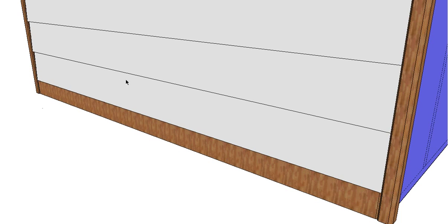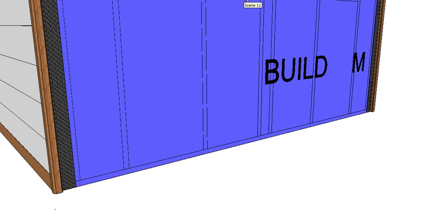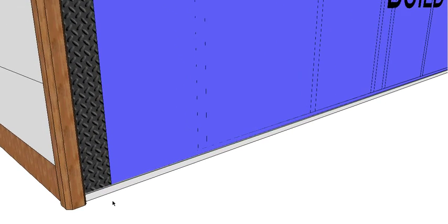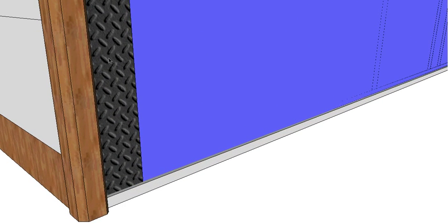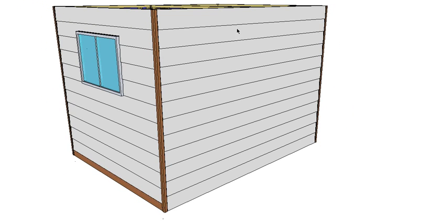The more common way to do it, there's your boards in place then. The more common way to do it is just to cut a strip off your weatherboards, and the actual top board you're going to have to run a strip off anyway, which is equal to your lap of your sheets. So you can nail that along the bottom, and that'll provide the kicker for your first board, so that they all sit at the same angle. The first one doesn't sit flat against the wall. So put your kicker in, and then you can install the rest of your boards.